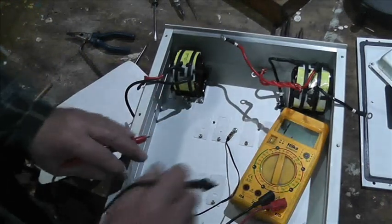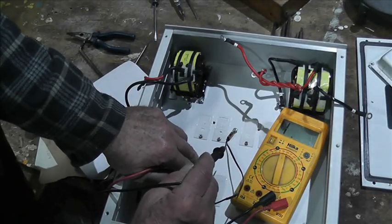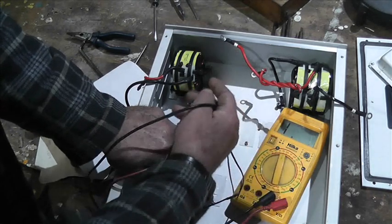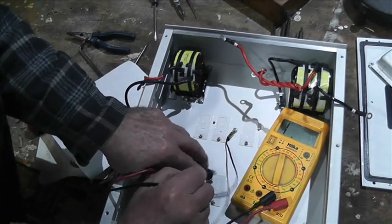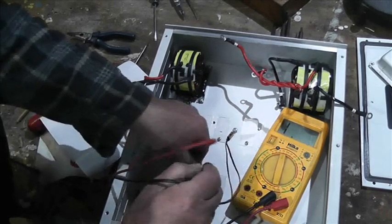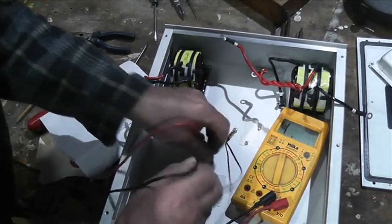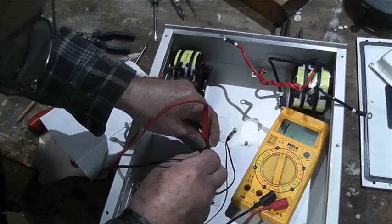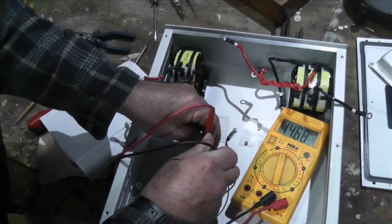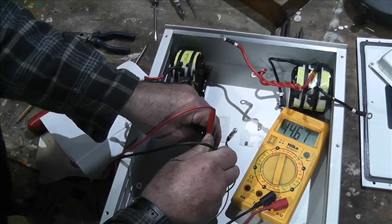This is the internal of an A4 grid inverter — solid aluminium, all cast in one, which is really quite amazing. There is the temperature probe. Putting the meter on it, it reads 14.6 on the 20k range, so that is 14k ohms resistance.